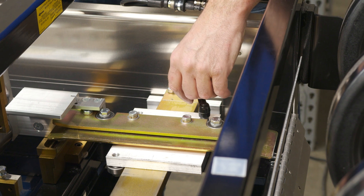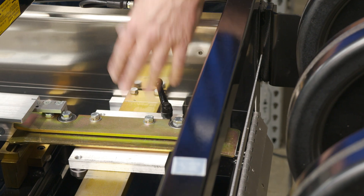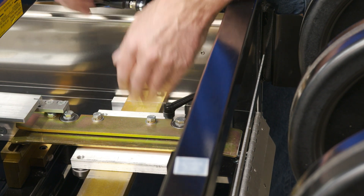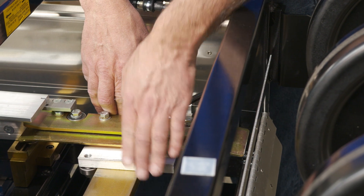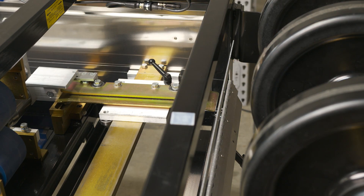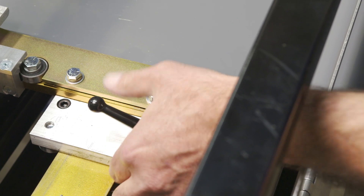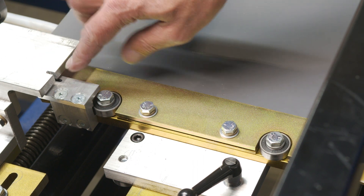Now that we're at the entry guide, we've got to know which way to move it to make it 5-16ths. For example, say our leg measured a quarter inch — we're too short and we've got to grow the leg. You loosen up your right shoe and move the entry guide to the outside to grow the material. Knowing we have to grow it by a 16th, you move the entry guide by a 16th — just tap it over to see a 16th move, then lock it down. Take your three-foot piece and put it back in the entry guide. Now if there's too much slop, loosen up the left side, slide it over until it's just snug with no play, then lock it down. Now we're off on our marking plate, so go to the crank handle and crank it so it lines back up with the notch.